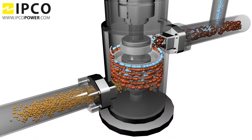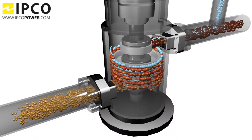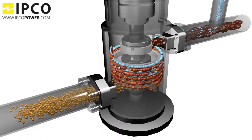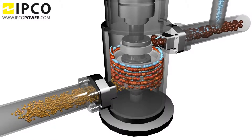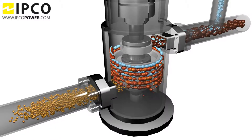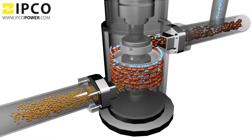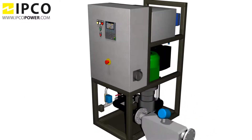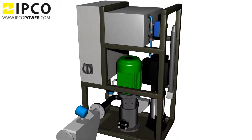With the emulsion, we can reduce the combustion temperature, so there will be less NOx and particulate matter emissions. The benefits of the water fuel emulsion system are a 2% fuel saving, 90% emission reduction on particle matter and soot, and an up to 20% reduction in NOx.